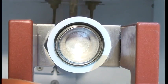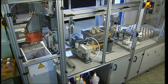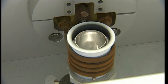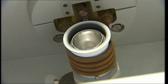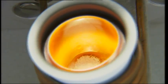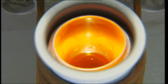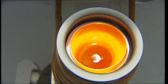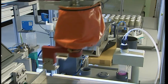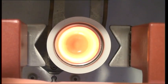After inserting the crucible into the furnace, the program is started. The crucible is inductively heated to over 1200 degrees centigrade. At these temperatures, the digestion salts melt and the sample dissolves in this medium. The melting operation is accelerated by the movement of the crucible. Reaction of the sample with the melting agent takes up to 16 minutes. Digestion is complete when a clear melt is formed.